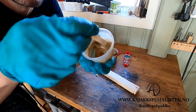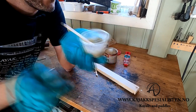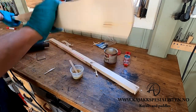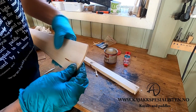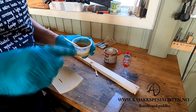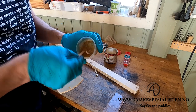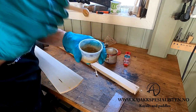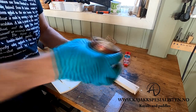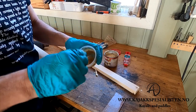And you can make it look pretty like this. Just make sure that it doesn't run. For the first time you do it, you can have a pretty thin and runny consistency of epoxy. When you build up the surface, you need thicker stuff so it doesn't run. First, you can cover it with epoxy that has no filler, then add the filler dust so that it has a thick consistency. This is too thin still — I'm gonna add a little more dust. That's better. Like peanut butter.